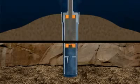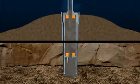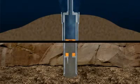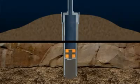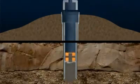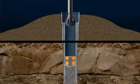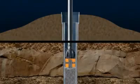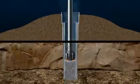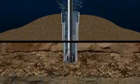On reaching the float collar, this plug is ruptured, and cement flows out of the bottom of the conductor and up the annular space between the wellbore and the conductor. The cement plug tool is removed, and when the cement has set, drilling continues with a smaller diameter bit, penetrating the cement plugs and float collar and into fresh rock.